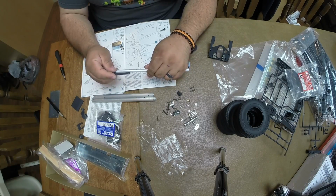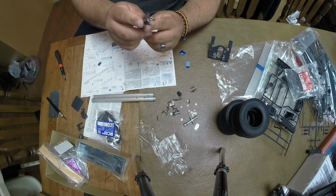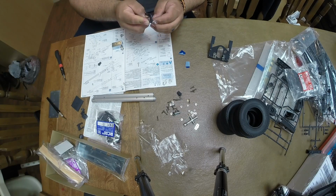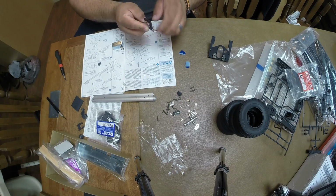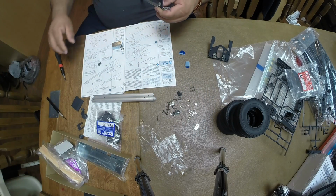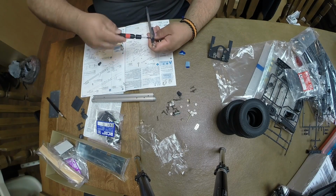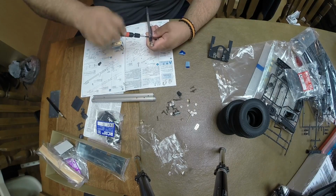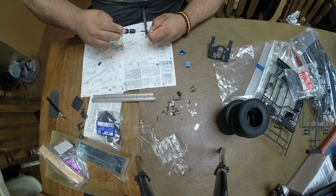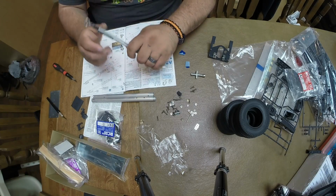and the front piece we just made goes through there and gets lock nutted on with an MA7 and a nylock. The MA7's a 3x15 mil and just your standard nylock. Now careful not to go too tight on this because you don't want to crush that tube. So just, don't want it to move around too much.